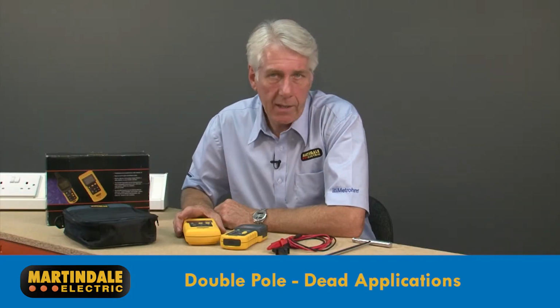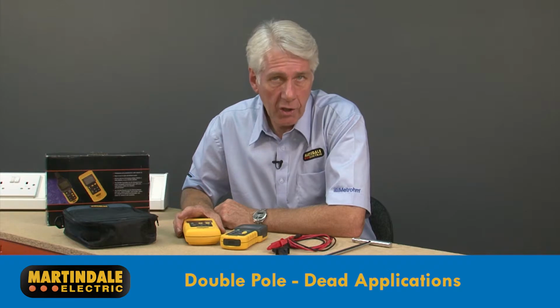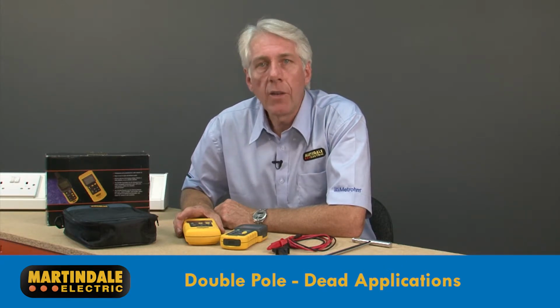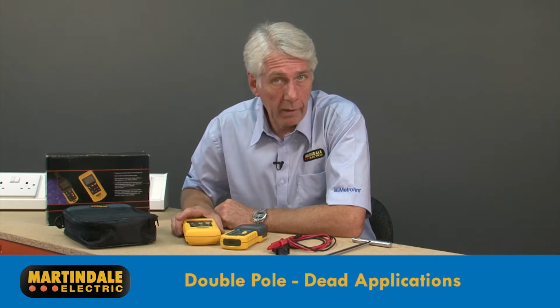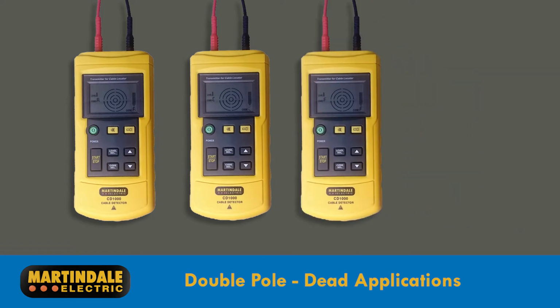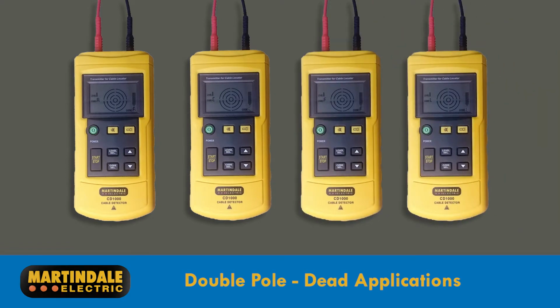Double pole dead tests include locating short circuits in wiring, detecting relatively deep laid wiring, and determining and sorting installed wiring. Sometimes for sorting, additional transmitters can be used and set to relay different codes. This can help identify a number of conductors very quickly.